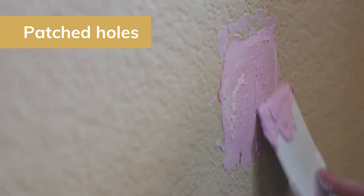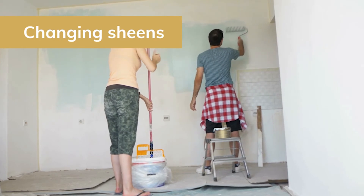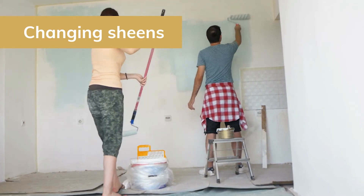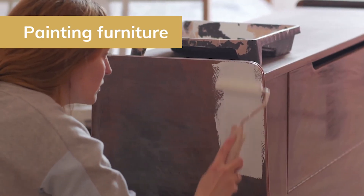Next: painting over a darker color or walls with stains. You definitely want to use a primer for this. I would recommend a stain blocking primer to prevent the darker color or the stains from coming through on that new coat. And lastly, in some cases when you're changing from a high paint sheen to a low paint sheen, or a different type of paint — like latex to an oil — you'll run into some issues. So it's always a good idea to prime when you're changing sheens or paint types.